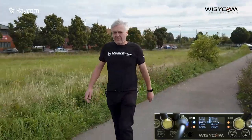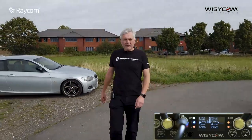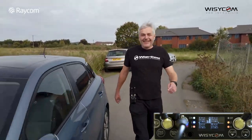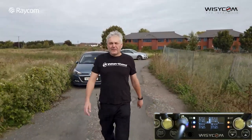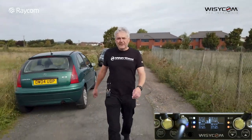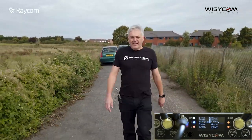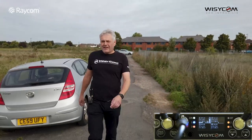There's very little chance of any interference coming in. These frequencies are incredibly clear. One of the advantages relative to UHF is the amount of noise you get from things like lighting and monitor screens - and don't go into the car, George! The noise coming in from all those sources of interference that you normally get is pretty much gone by the time you get up to DME, so you get a big advantage in noise floor.